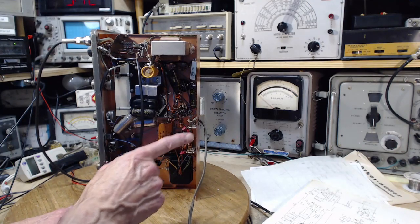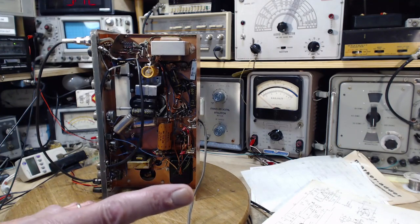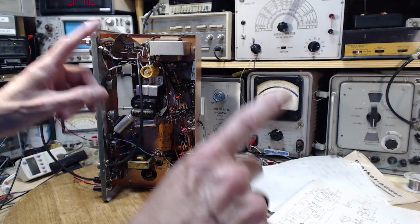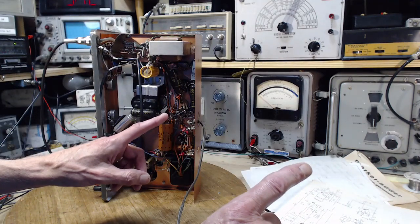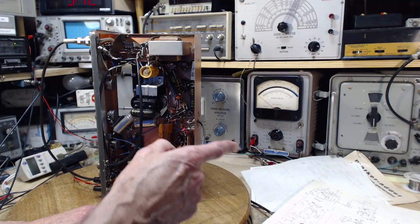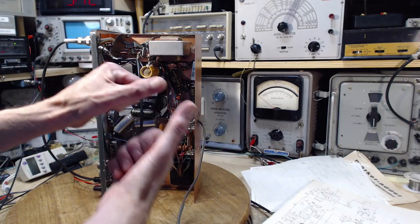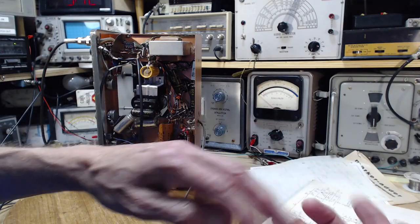And that wire will travel all the way to the secondary of a super high voltage transformer where there's another star connection and another ground point. Those two ground points are a distance apart. Even if it's not just ground rods, even if it's connections to the hydro neutral, there's resistances involved and stuff like that. What can happen is you can get a current flow, believe it or not, through the star neutral, through the windings of the transformer, out onto the power lines. This is DC now, traveling down the power lines, up on the poles and all that stuff. Coming through people's equipment and motors and stuff like that, and three-phase equipment, finding its way back to the ground.